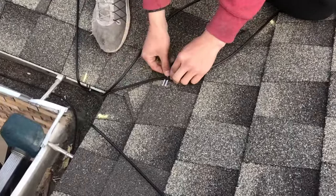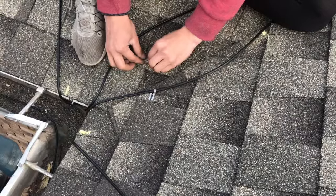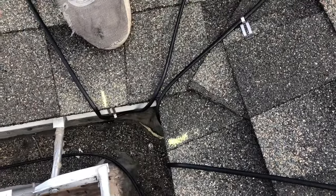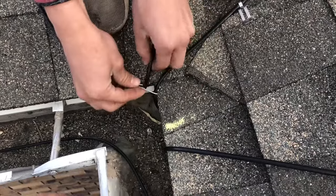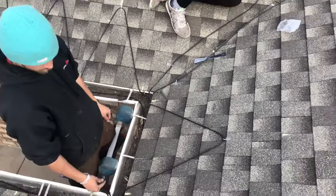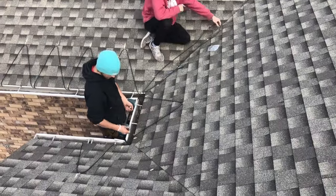When you come into the valley, you want to make sure you clip your clips to the shingles on the sides — they have a better secure hold that way. In this valley, you're going to want to make sure you don't have heat cable lines touching; this is a common mistake made. Once you've started securing your clips for the valley, go ahead and set the peak part of the valley, and then set your clips in between to secure the cable so it doesn't blow around in wind or whatnot.